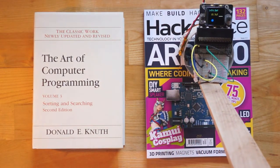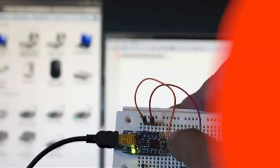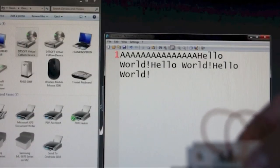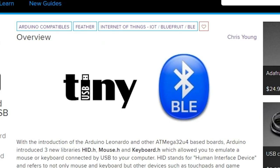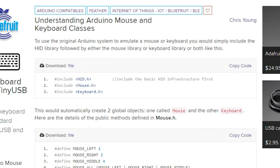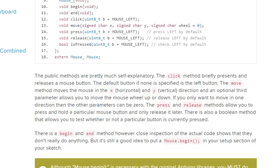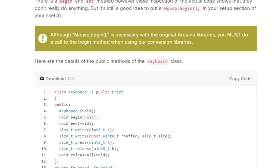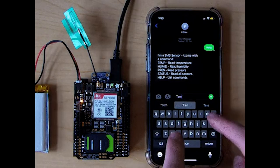Time for some tips and guides. Ever since the Arduino Leonardo, microcontrollers have been able to emulate keyboards and mice using the Human Interface Device libraries. However, most modern computer peripherals have begun the shift over to TinyUSB, a more modern protocol. Now there's a new series of libraries to help bridge the gap between the older, simpler code base, allowing them to behave like modern peripherals including BLE. The TinyUSB library both unifies and simplifies the code process, which is what any library ought to do.